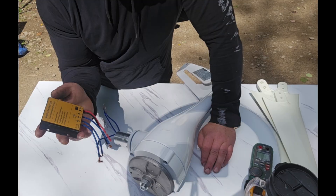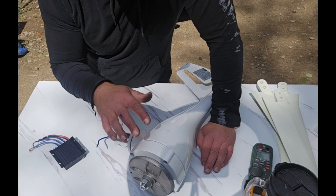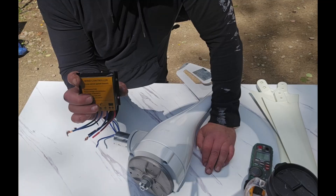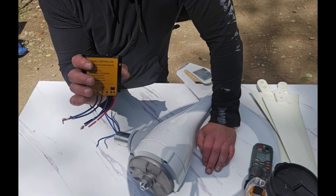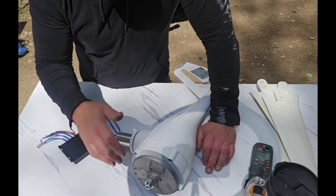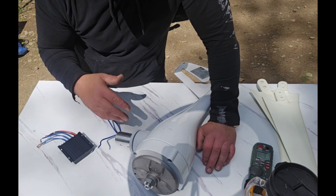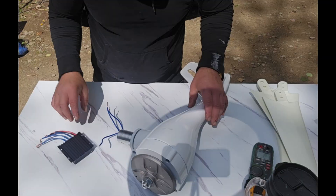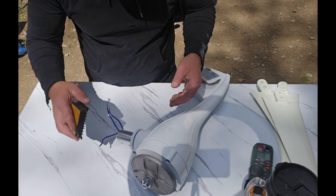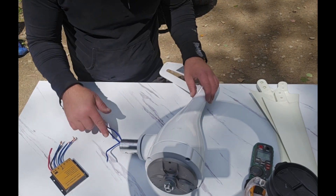This is exactly like a motorcycle regulator rectifier. One thing I've learned about motorcycle regulator rectifiers is you want to keep them in the wind - if you're in a high wind area with constant high wind, keep these cool because they heat up. There's quite a bit of efficiency and energy loss through these, especially if you're kicking voltage down to 12 volts. So far, this one gets up to 60 volts AC plus for each leg, so we're cutting 60 volts AC all the way down to 12 or 24.